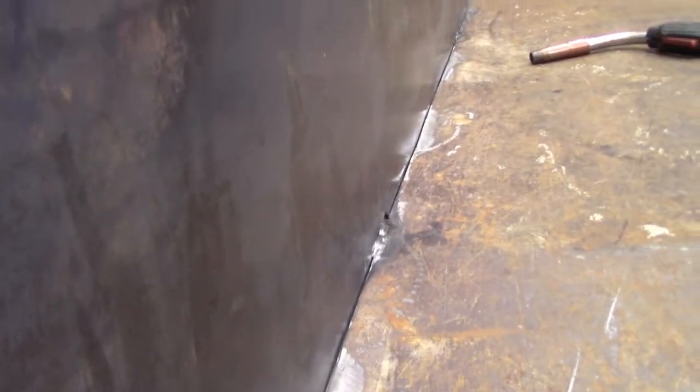And what happens is my vertical wall is a good 1/16 of an inch away from the floor of the bed. So all I did was take an old splitting wedge that I actually found in the dirt outside, and it's just enough weight to push that angle iron in and hold this against it while I stitch it in. So don't forget to use your wedges. Thanks, Brupeg, for showing me that and helping me apply that to my situation.